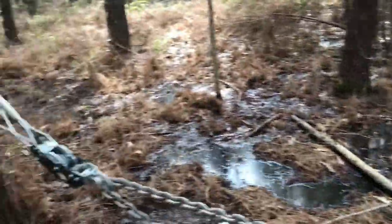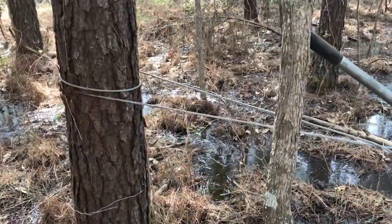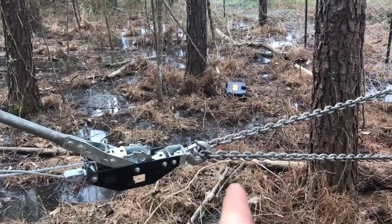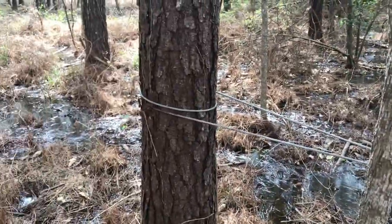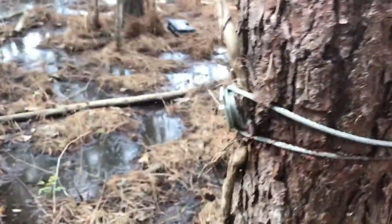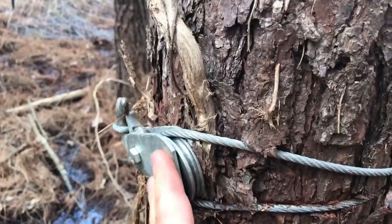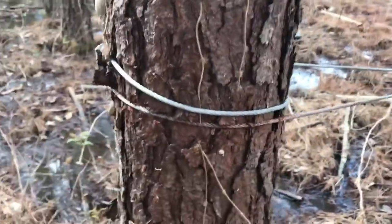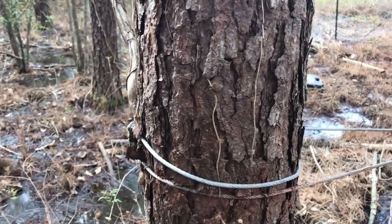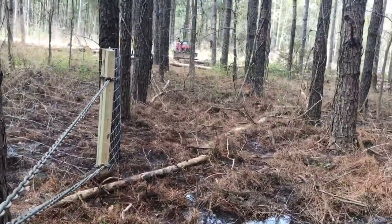The other thing I was gonna show you is how I'm having to stretch this one. The other night we just hooked onto the bucket of the tractor and I could park it wherever I wanted, but I don't have that here. So I actually reversed the come-along — I got my chain at what would normally be the dead end, wrapped the hook around the tree, and hooked it back to its own dead line. Now as I'm ratcheting it down, the pulley is working its way around and into the tree, but I think that damage is pretty well done and it's not gonna hurt the tree long term. I'm gonna put a few more clicks on it and then start walking the line and driving in nails.